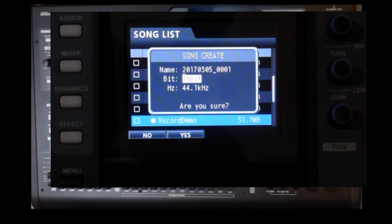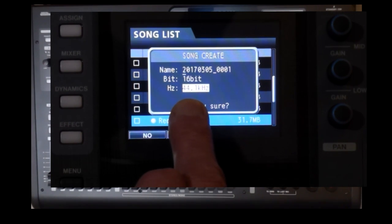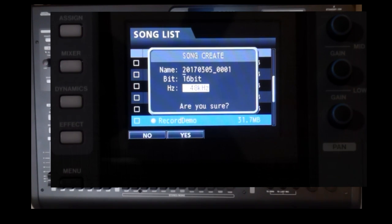Another compromise. The number of snapshots or samples you take every second is called the sampling frequency. And this machine again offers 2 options for this. They're here. 44.1 kilohertz, which is 44,100 snapshots per second. And the other is 48,000 per second. The higher the number, the better the quality. And as we saw with an earlier video, this setting affects the highest audio frequency you can handle.